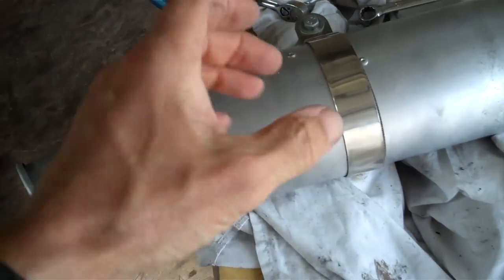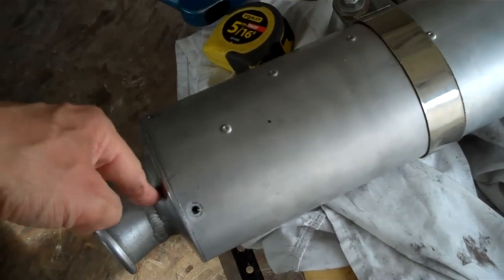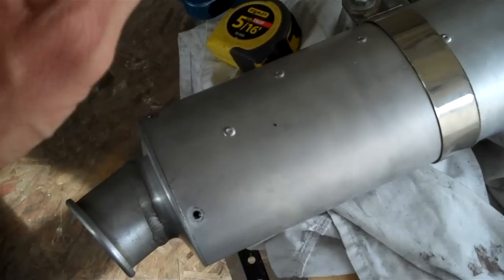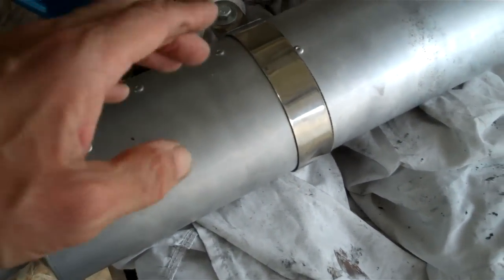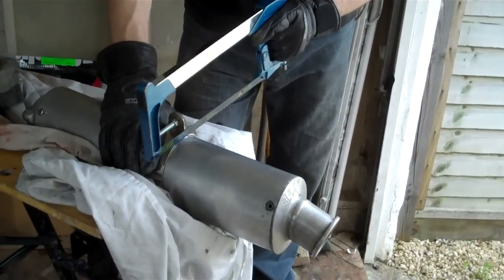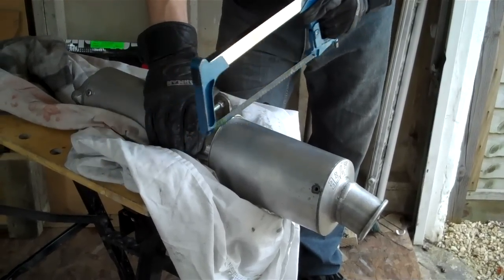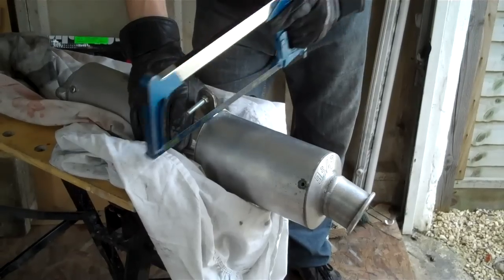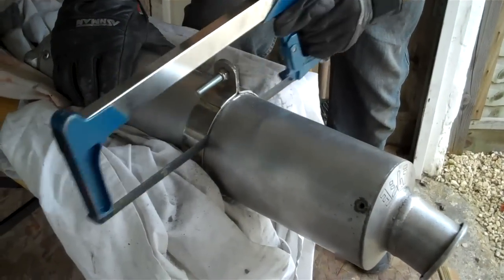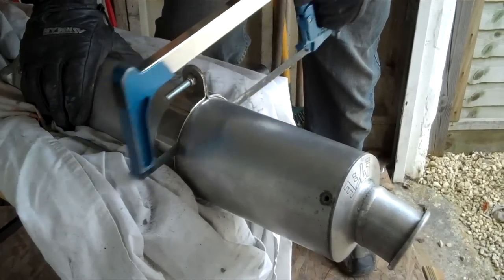All I've got to do is run the hacksaw perfectly, carefully, and slowly right the way down through it. I'm going to cut the thing in half and then beat this end cap off from the inside. Even if I have to destroy all of this, I'll be able to get to that. Once I've got to it and it's naked, I can grind that surface down so it's a bit smaller and it will then go in this end cap. Starting off with a brand new Eclipse blade - nice and crisp and sharp - up against the stainless, it'll go straight down through.